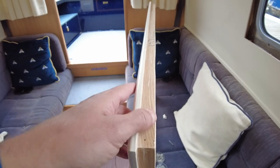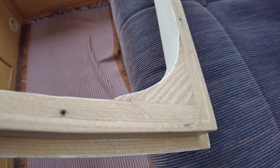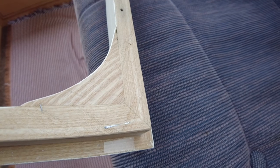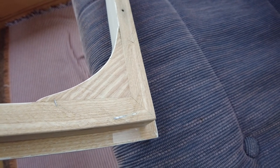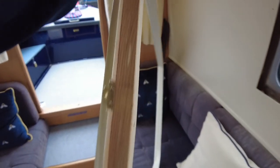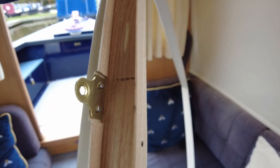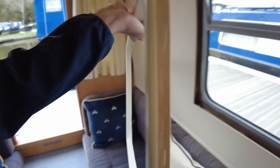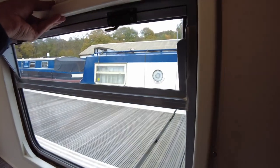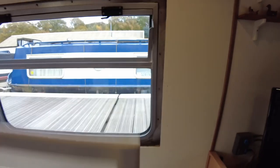It's a little bit of a nuisance and takes about an hour because it's hardwood, and there are also a couple of metal bits where you have to use a hacksaw — you can hear a metallic sound with a wood saw by hand, so you just take a hacksaw and carefully cut through there. So 6 millimeters has been removed from the inner, and the mounts have been carefully chiseled and made flush. That's it — it's as simple as that. This goes up with two little screws left and right, and that's how quick and easy it is now to remove these frames to paint, varnish or stain them.